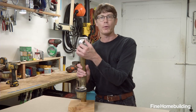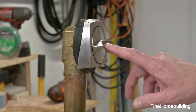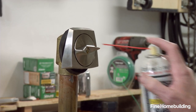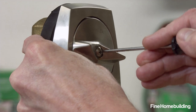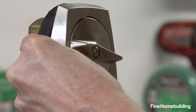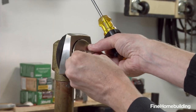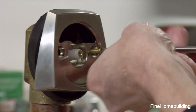This is another popular style of tub drain — let's see how this one works. First you have to remove this knob. I like to hit it with a little penetrating oil and clean out the head so you can get a good bite with the screwdriver, as they're often filled with corrosion or soap scum. This one takes a number two Phillips driver. Then you can remove the overflow cover by taking out these two screws.